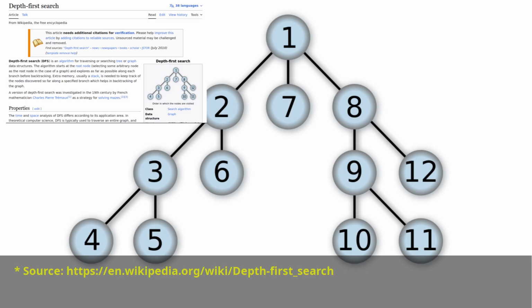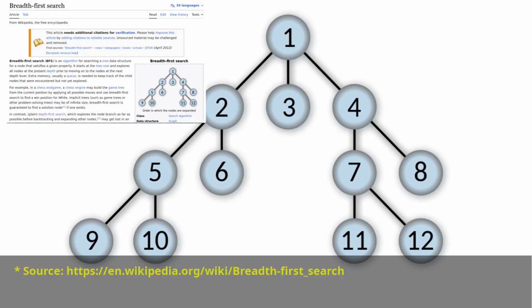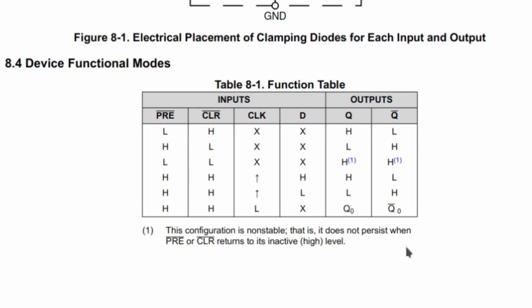This emulator is written as a depth first processing of a tree, where all the different signals process deep all the way down one pin first, all the way to its end, and then kind of traverse its way back up, executing any additional slots for any particular signal. Real hardware all happens in parallel, and it more resembles a breadth first, or going wide across each level, before it goes deep into any additional children. And at some point, I'm going to have to come up with some method to change this from depth first to breadth first on my emulator.